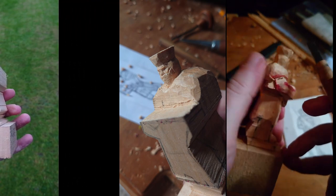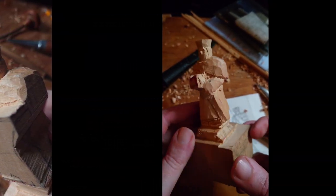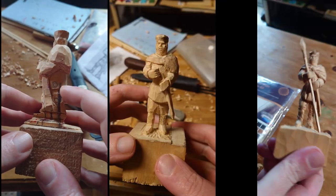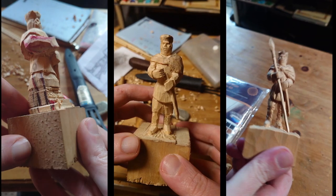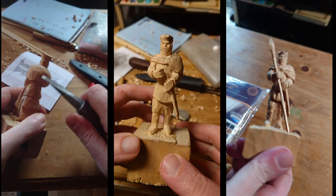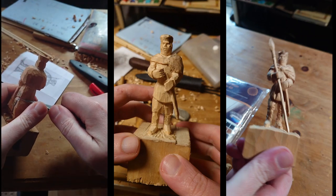I'm going to come in with this little chisel again and keep cutting away bit by bit — obviously if you're going to do this yourself, be very careful of your hands. So now that bit is cut. After I clean up the hands and make them the right size I can move on to the lower half. I'm going to work my way down to the legs — this leg is the one that supports the weight, which is why it's kind of straight and firm on the ground; this one's more of a posing leg so it sort of bends forward. We'll do that with some V cuts.